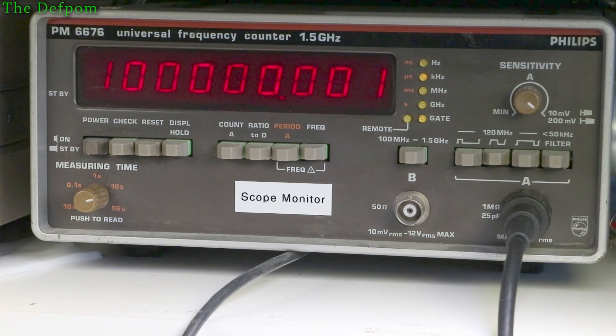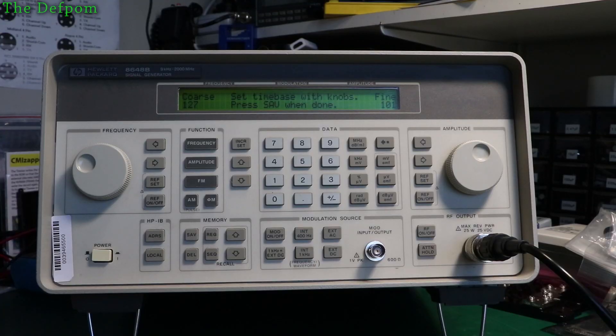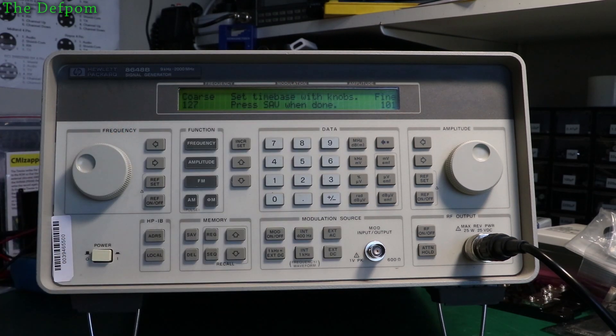It's not easy to see the gate flicker because of the lighting. That's looking really close — it might be a fraction high but I'll leave it there. So we're measuring down to 1 hertz resolution, which is not bad. The counter is still saying exactly 100 MHz, so I'm happy to save this setup. The coarse is 127 and fine is 101, fairly well balanced and within 1 hertz.